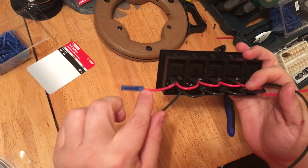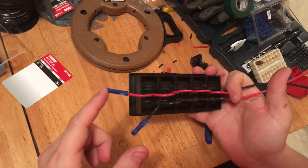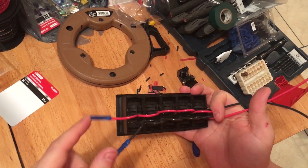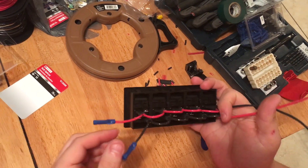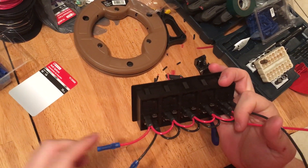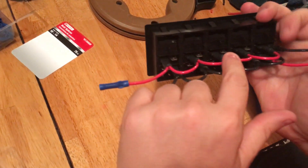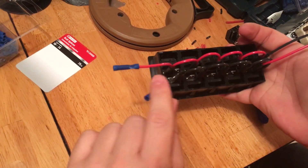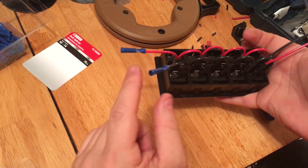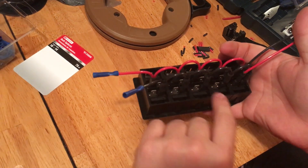So if you're looking at the front of the panel and you turn it around, red is going to be positive and black is going to be negative — this is coming from the battery. The positive goes to the top left, and because I'm powering the entire panel I've got it daisy chained to the top left on each switch. The negative from the battery goes to the bottom right and daisy chains to the bottom right of each switch as well.